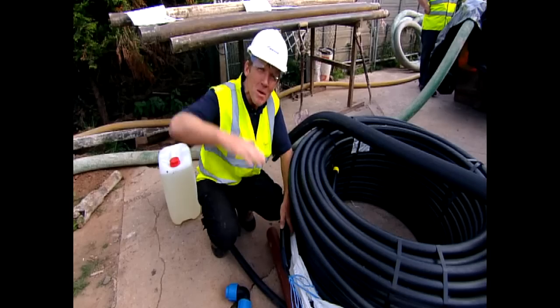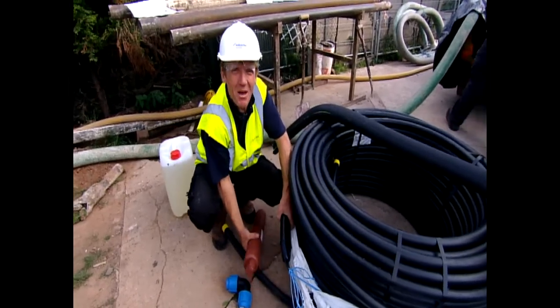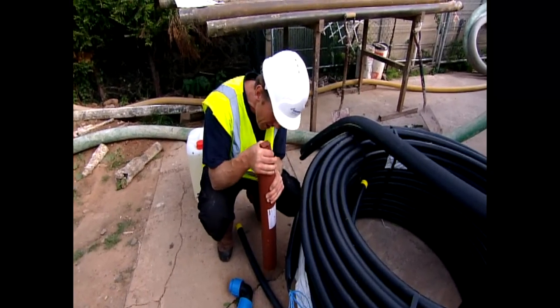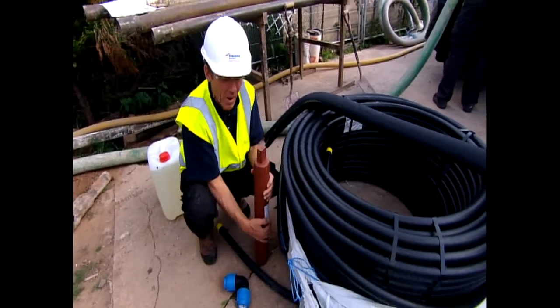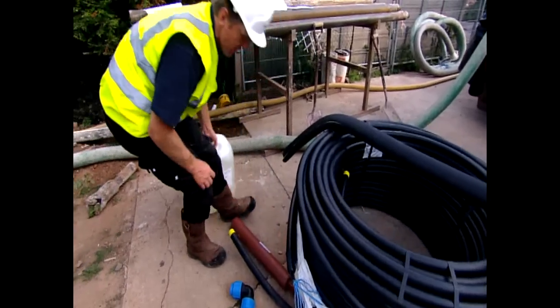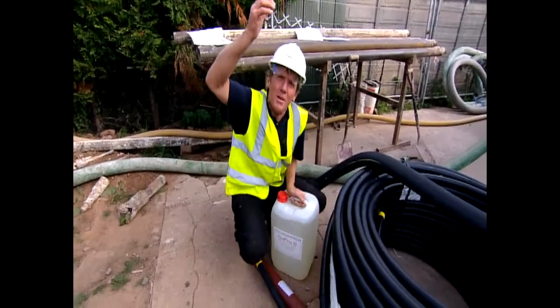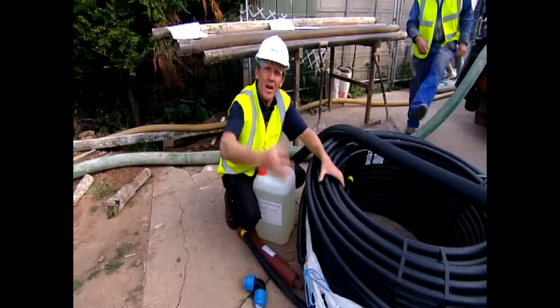It's made to withstand extra pressure. Because it goes so deep, it's going to have a massive static head on it. Onto the end of that pipe, to make sure that it doesn't float back up and that it goes right to the bottom of the hole, they put this massive weight. This is bolted onto the end of that pipe. It's twin-walled pipe. The water and glycol mix, which is over here, is going to be put into the pipe. The pipe is lowered down into the hole — filled up, weighted — and that will sit in there.